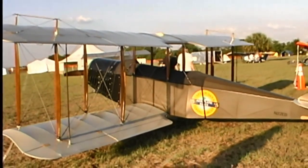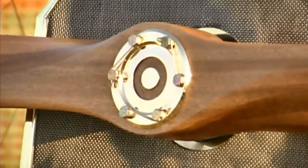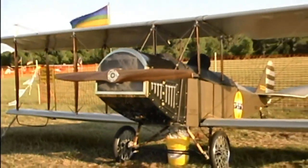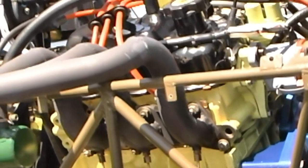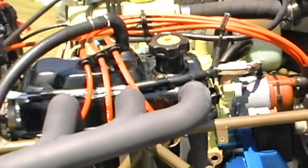What are we powering this with? This is a three-cylinder Suzuki. It came in two different variants — the Sprint and the Metro. This is the earlier one, the Sprint. You can tell the two apart because the Sprint has a wider stamped steel valve cover and an entirely different cylinder head. It's something I built from the crank up. It has a few cylinder head modifications but is pretty much a straightforward stock engine. How much would it weigh? The bare block with a flywheel but no manifolds weighs 108 pounds. But this one's got dual ignitions, the re-drive, and three carburetors, so I'm guessing 150 to 160 pounds.